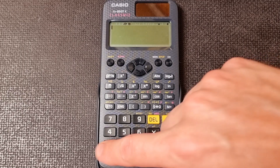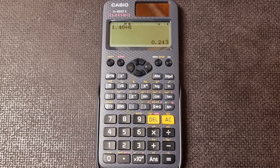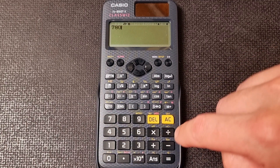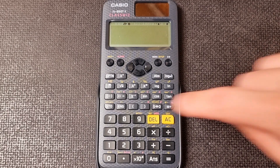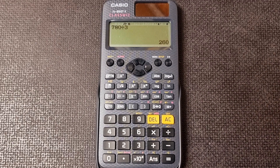Obviously we can't do that in the real world, so we always round this number up — in this case to a value of 6. So if we divide that length of 1.46 metres by 6 we get 0.243 metres or 243 millimetres. Then we look at the width of the area and try to get about the same distance between measurements in that direction. 780 millimetres divided by 243 gives you just over 3 measurement points, so dividing the width by 3 gives 260 millimetres — only 17mm off the other measurement and not higher than the minimum spacing calculated at the outset.